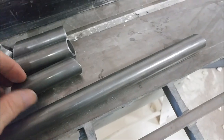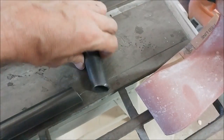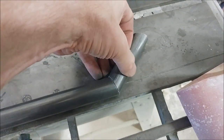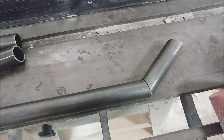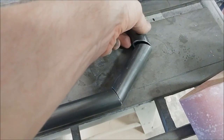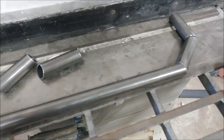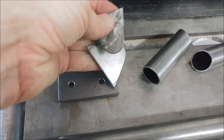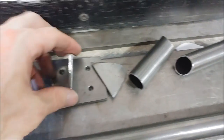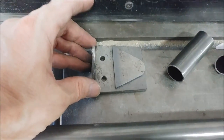Moving on — starting out the week I started cutting the tubes for the side sticks, putting together the pieces that make up more of the flight controls. Jeff's already done quite a lot with the pulleys and brackets, but it was time for the next step. These side sticks are basically a long 4130 steel stick with an angle cut at the bottom that turns 90 degrees — two of them. I also cut a bracket that will hold the endpoint before the retraction cylinder for the nose gear, which needs to be welded up.